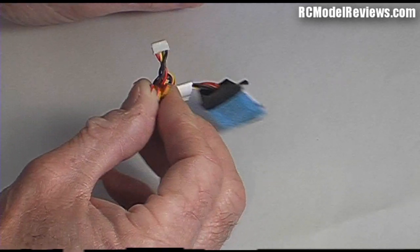Here is possibly the next most useful sensor: the Vario. You might think, 'What do I want a Vario for? I just want speed, altitude, and battery voltages.' Well, the Vario is essential if you want altitude information. Believe it or not, even though FrSky sell you this GPS unit, it doesn't give you altitude on screen — if you want altitude you have to use the Vario. I've spoken to FrSky about this and they've sent me new software which may change that, but at the moment the GPS altitude data doesn't display — it only shows barometric readings from the Vario.